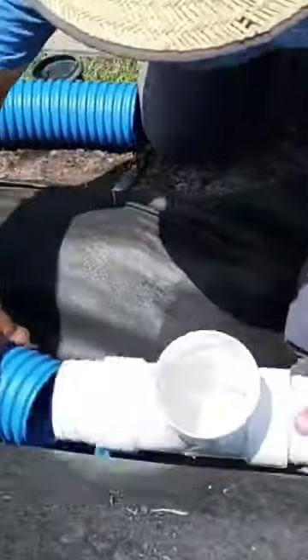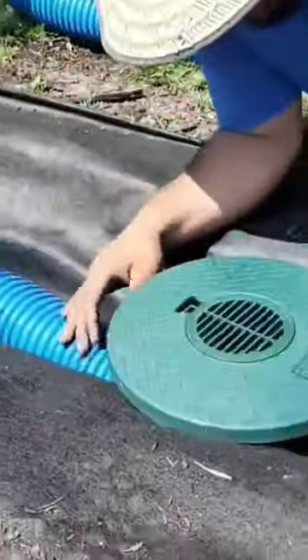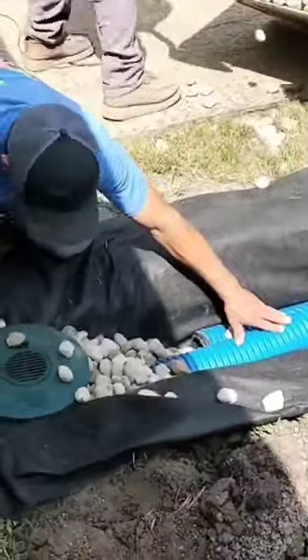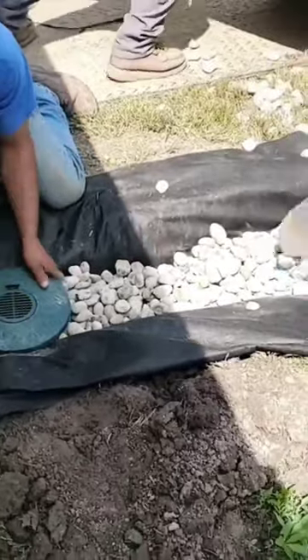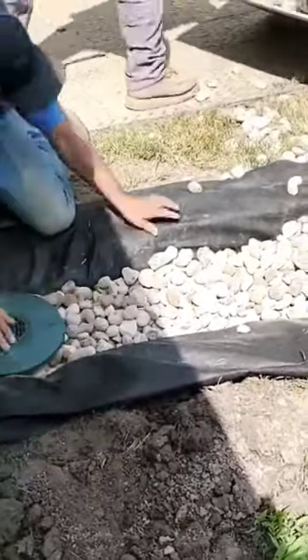You just slip in one of these inlines, and these are directional tees. I love them. When you install these directional tees, you want to pay attention that you're installing it correctly and you don't install it backwards. When the water goes through that inlet, it's going to go down into that tee, and then it has a sweeping motion to get it going in the right direction.